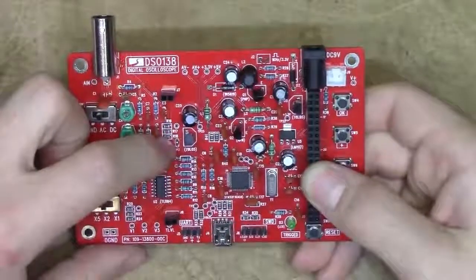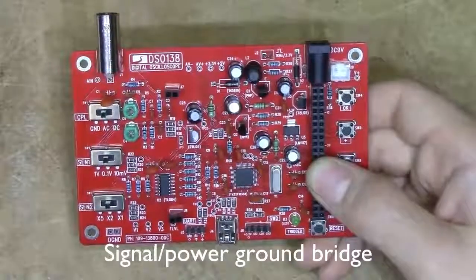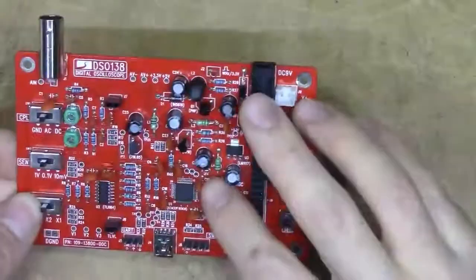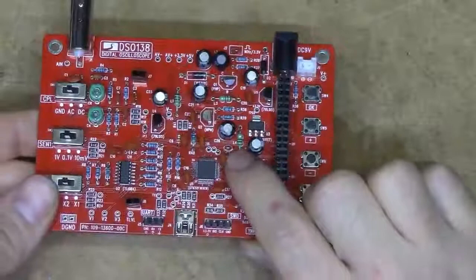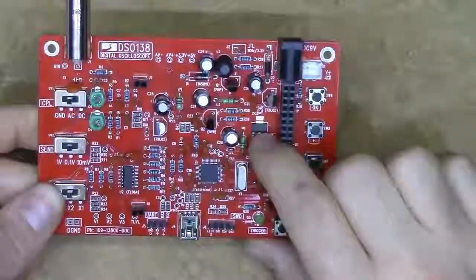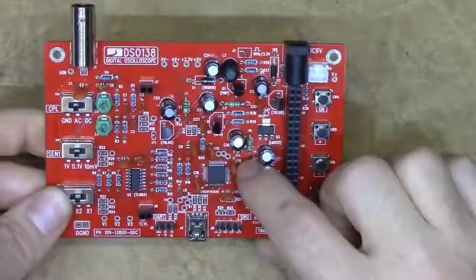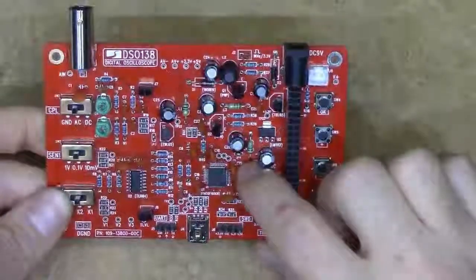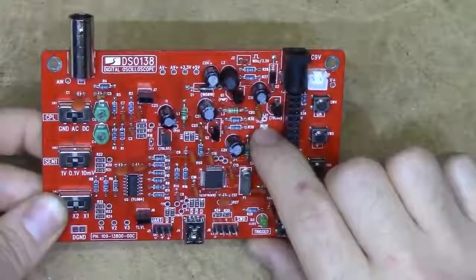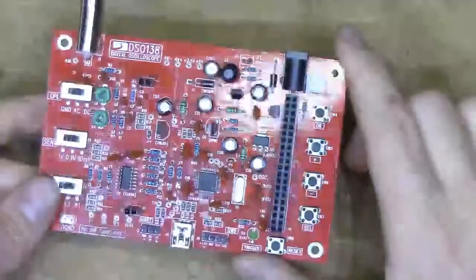There's also another jumper which you're supposed to short after checking that the 3.3V regulation works — this just jumpers power to the processor so you have a chance to verify you don't have 12V going into your processor and frying everything. They tell you to check test point 22 but don't specify where to reference it — obviously ground, which you can get from the DC plug or a pin of the regulator. The board was otherwise very easy to solder, very clean, no excess oxidation. I'm honestly impressed by the board quality — no pads lifting, all vias through-plated. Big thumbs up to the manufacturer for producing a proper board.